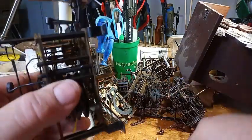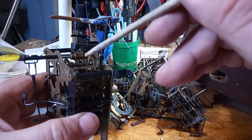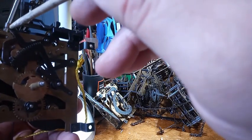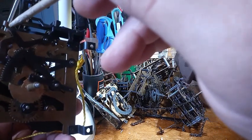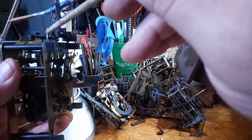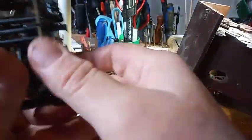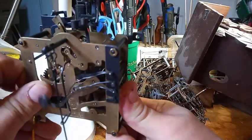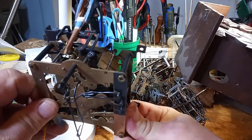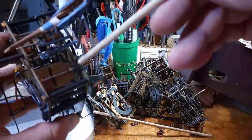When it's done, the third wheel warning pin — remember, the third wheel is always next to the governor fan — when it's done the third wheel warning pin will hit the rack stop lever tab. So when it's done cuckooing, as you can see it's going in and out of that notch, and then it stays in the notch and the third wheel warning pin hits this tab.